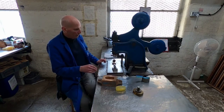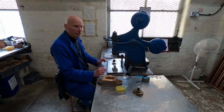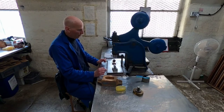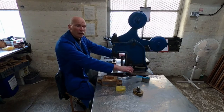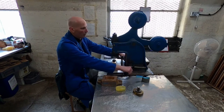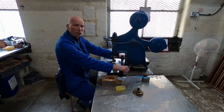The operation of this machine is by foot pedal. The operator pushes down with the foot pedal until the safety handles are engaged. Pulling back the safety handles allows the foot pedal to carry on and the stamping motion to continue.